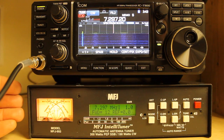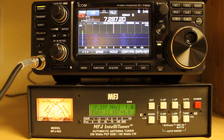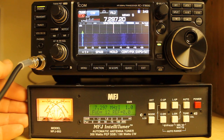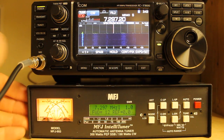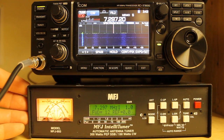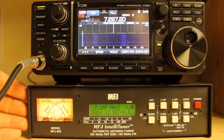From the amplifier I go to the WM1 computing wattmeter, and then from there I go to the SA-2040 tuner and out to the 80-meter loop, which is not very high but works well enough — it's an Invis antenna. Most of my 75/80-meter operating is regional nets anyway, so that's not a big issue.